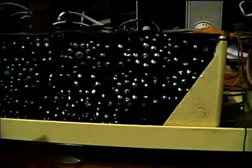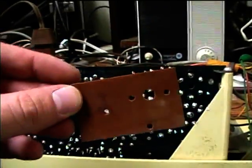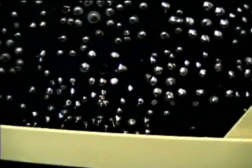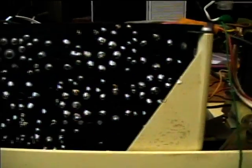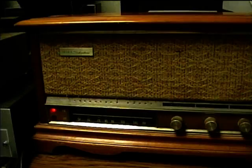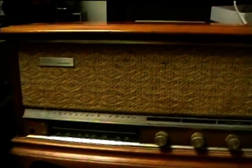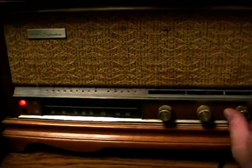I've got the FM working. I had to remove the shield from under the IF amplifier tube — it just solders on there. But I soldered just about everything in the FM section, resoldered everything on the circuit board, and that fixed it. Here's the completed FM radio. FM performance is now good.